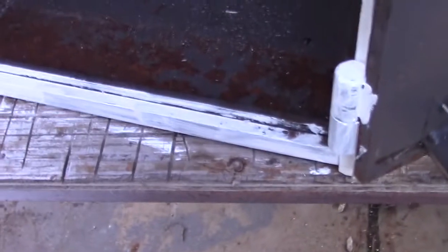So the front two, the place it's going to go, there's concrete up to about here, and then I can pour fresh concrete in there and just put some J-bolts, so I don't have to drill those. But these two I'll have to drill. So I put the safe in place, mark the 2 spots, and then take the safe off, drill them, put the safe back, hammer the red heads, and there will be fresh concrete there, and just dip the other bolts into the mix.